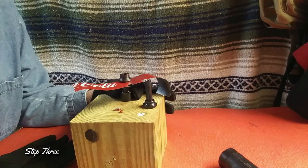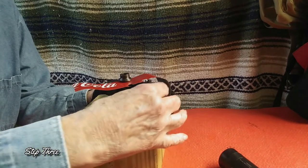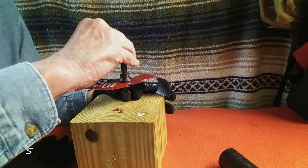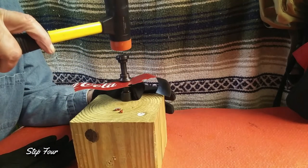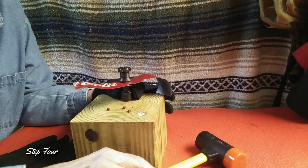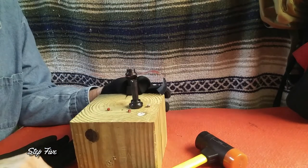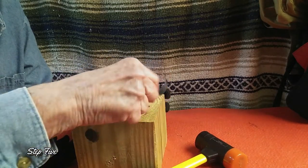Insert the aluminum strip in the feeding slot of the number 11 percussion cap maker body. Insert the punch carefully into the guide hole. Place it on a solid base and tap the punch downward with a plastic hammer or soft mallet. Use light taps to begin with until you get the feel required. Be sure to hold the strip squarely against the back of the slot. Extract the punch and invert it. The finished aluminum cap will fall from the exit passage.